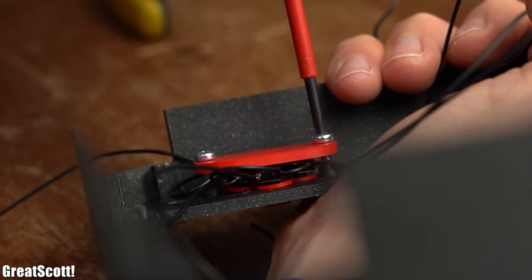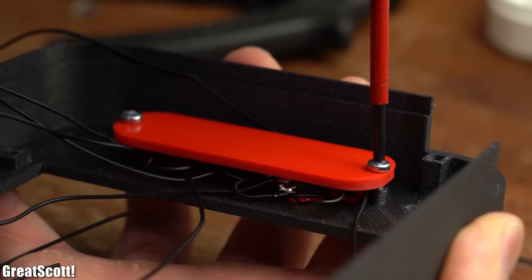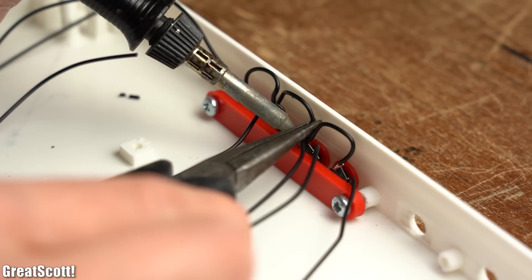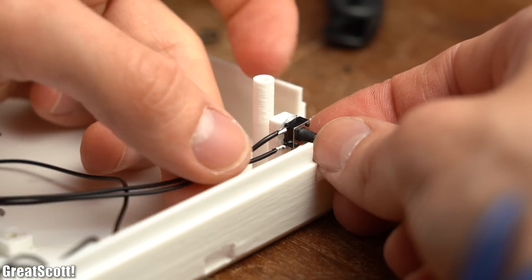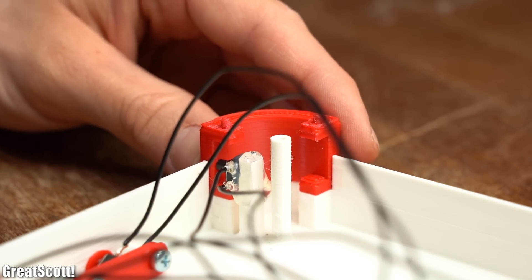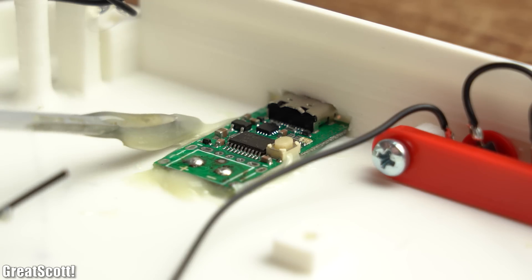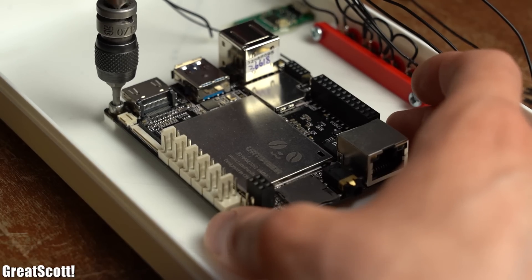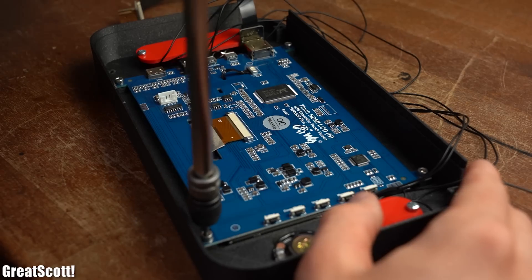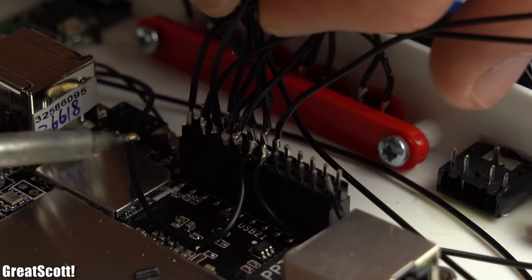You need to fine-adjust the distance of the mounting plate until you get a satisfying button push. I repeated this process for the other side as well as for all the buttons of the screen and the Latte Panda power button. I also hot-glued a tactile push button near each shoulder pad and confirmed they would work mechanically. At this point I secured the speaker, USB Type-C PD PCB, and audio jack inside the housing with 2-component adhesive, then secured the Latte Panda and screen with M3 screws, added male headers to the Latte Panda Arduino, and wired up most of the buttons. The rest got connected to the screen or the Latte Panda power button.